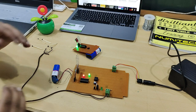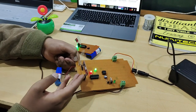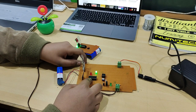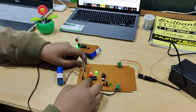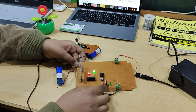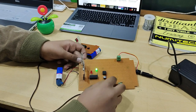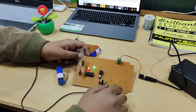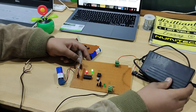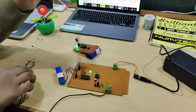Now let's see the second side of our project — the receiving side, with a 9V battery to control the electronics. Here we have a receiving module with the antenna attached to it. We have a decoder IC named HT12D, where D stands for decoding, and a bunch of LEDs. We have made an op-amp module using the IC LM358, and used an NPN transistor to invert the output. Here we have a MOSFET to switch the current transmitted to the nichrome wire, and here is our high voltage, high current source providing 12 volts and 5A of current.